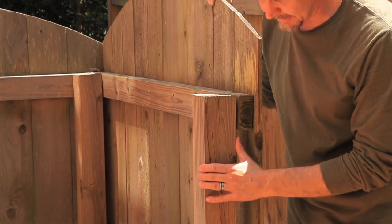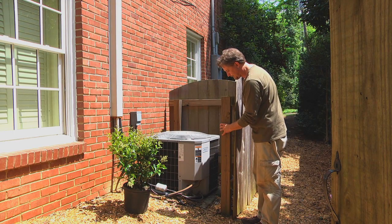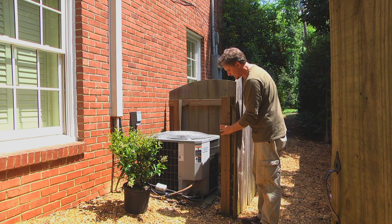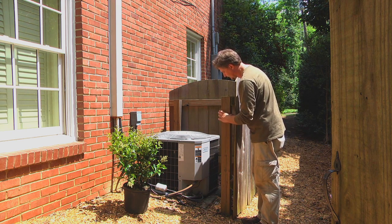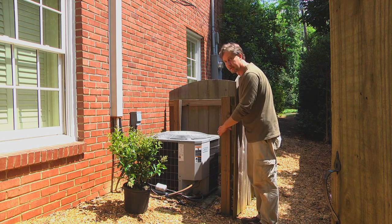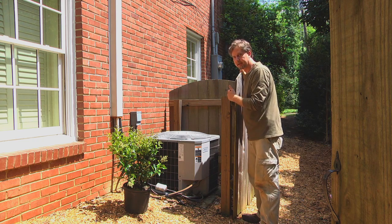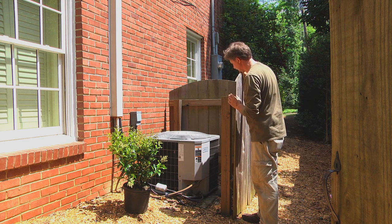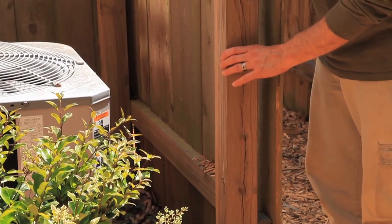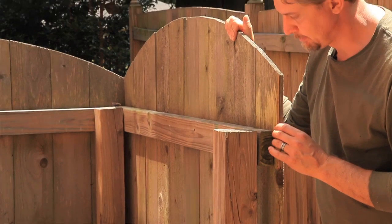If you're going to custom make this, and even with the prefab, you would need to dig a hole with a post hole digger or a soil auger. I would go about a foot across and then put the four by four post at least a foot to two feet in the ground and pour concrete in the hole. Also make sure that these four by four posts line up properly so that the fence is straight when you go back and put the fence on. After you pour the concrete around the post, you may want to let the concrete set up for a couple of days so that it cures enough that you can go back and put these panels on.